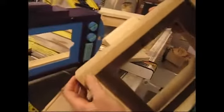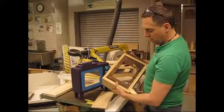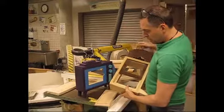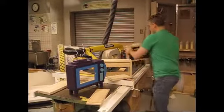you can see there's a rabbet joint here, and the rabbet joint works really well for younger students, because if it's done properly, you can either use the table saw or the router to create those joints. If you do it properly and the wood's all squared off, it works out really nicely to square out, and you don't have any issues. Again, by making it a little bit larger, you eliminate any possibilities of making it too small, because that's obviously a problem as well, okay?